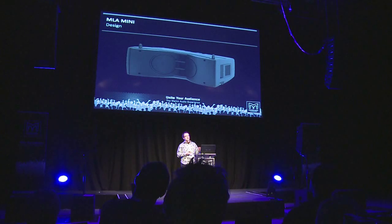The high-frequency section uses three one-inch compression drivers specifically designed for this product to cross over at a very low frequency without the distortion effects typically associated with that. The crossover point between the bass drivers and the one-inch drivers is 1.2 kHz. On the side there's a port covered with a waterproof mesh because the product can be used outdoors, and this extends the frequency response of the MLA Mini down to below 85 Hz — meaning it can actually be used without the subwoofer in some applications, such as speech.